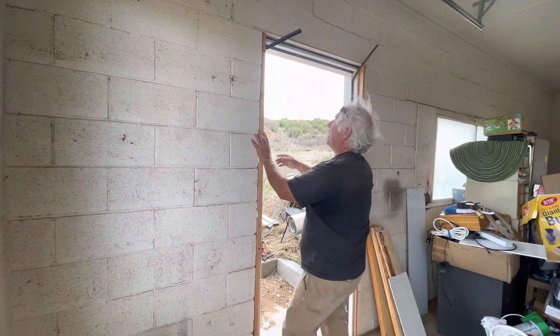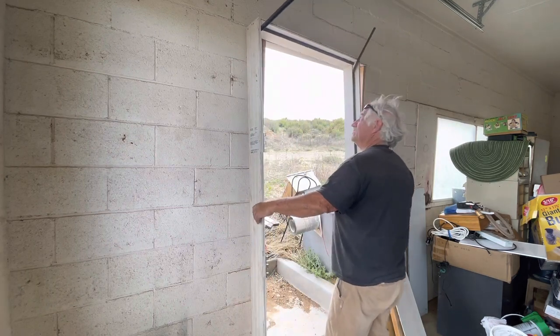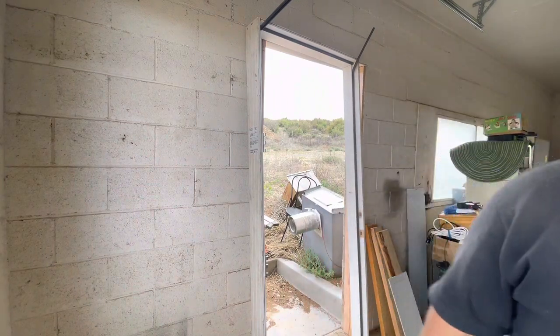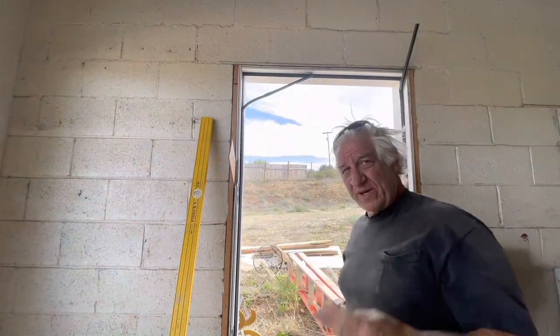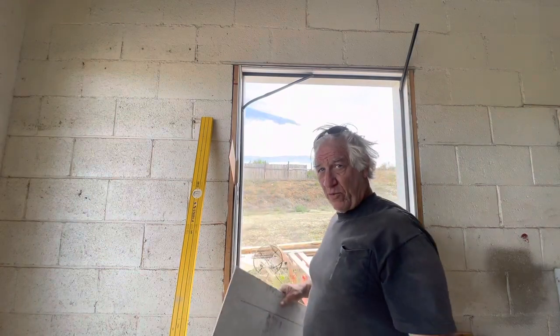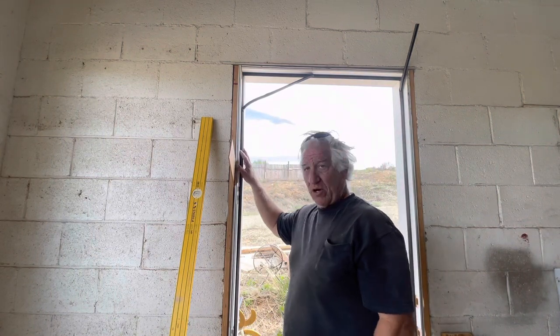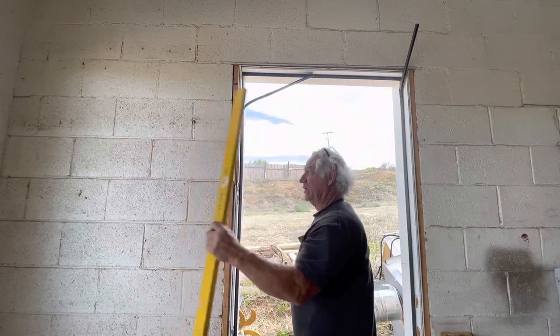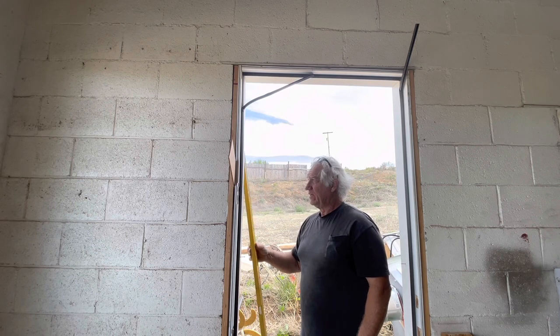I actually should drive another screw in there real quick, and I will, all right? So bear with me, don't go anywhere. You don't wanna miss this. Okay, folks, so remember, there's three things that you're battling when you hang a door besides 400 pounds. You want it square. That's very important. Really, that's the most important thing, to be honest with you. It'll get out of square if it's racked. How's it racked? This way, if these aren't plumb, and this way. So if you look at this, I've got this pretty level. All right, I'll show you if I can here.